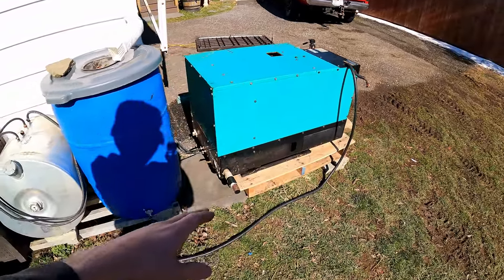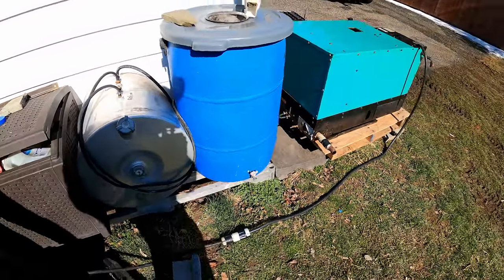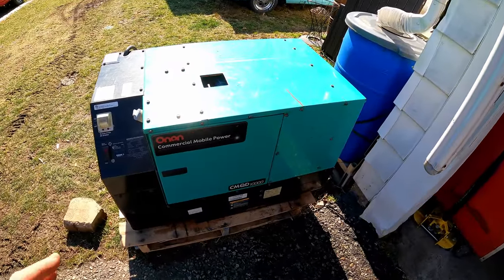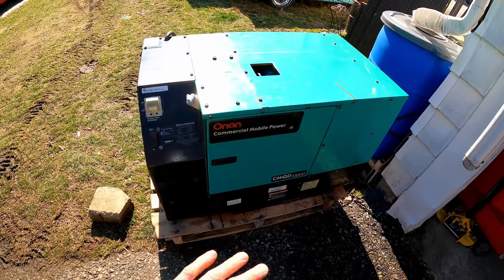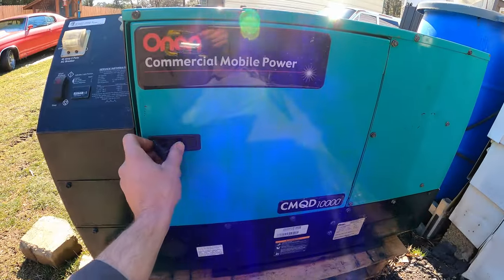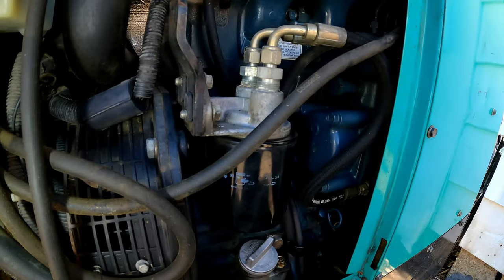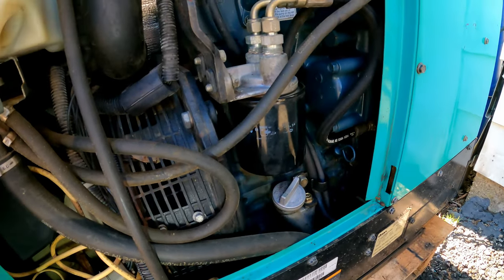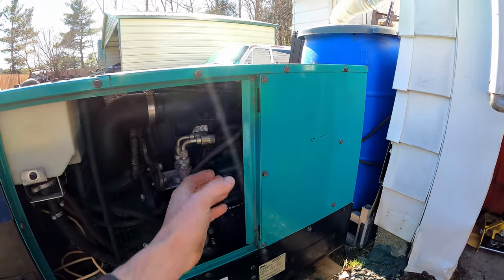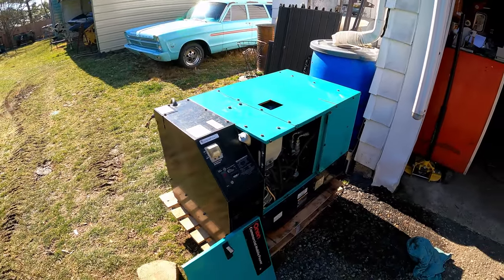The Onan only needs one 12 volt battery to start. It does not have a built-in fuel tank, but this one came with an aluminum tank off of a reefer trailer. The biggest reason I upgraded is because this has a Kubota D1703 1.7 liter three cylinder diesel, and it runs super clean compared to that old Lister Petter — just a much, much better engine. Let me show you what that looks like inside. There's not as much access to work on this, but it's a much more compact design. It does kind of stink that it doesn't have more covers that come off — you have all these 10 millimeter bolts to take off to expose everything. Let me fire this up for you now.